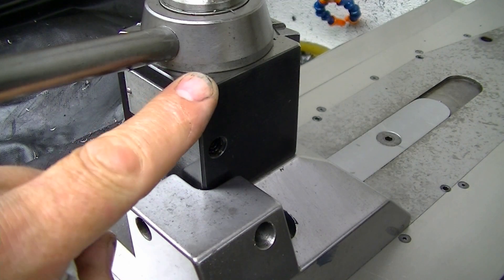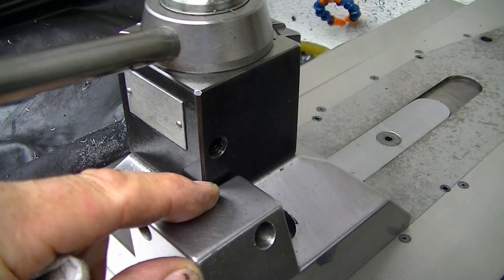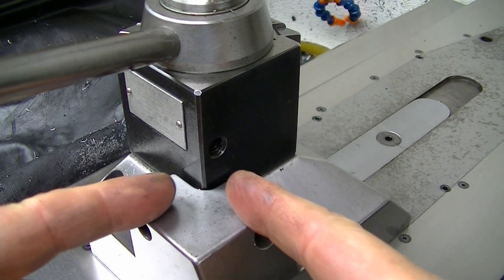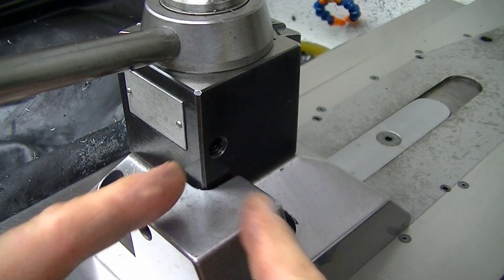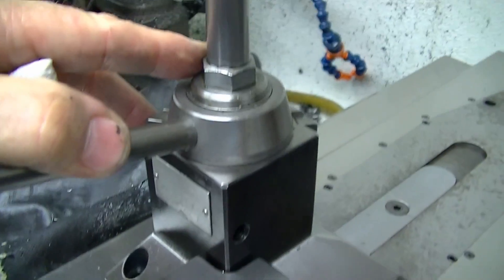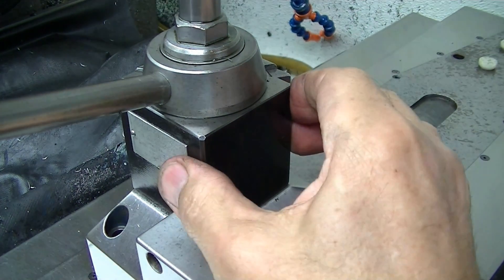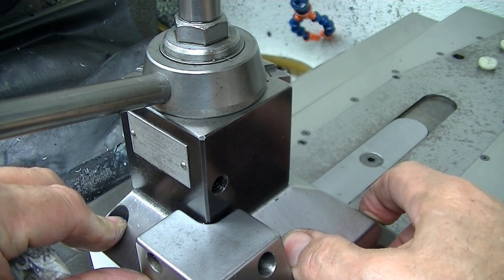There's a corner on the far side of the tool post where a dowel pin hole is hard-drilled into the hardened body. It also has a relief so the dowel pin hits on two spots — a smaller diameter relief groove that allows the dowel pin to sit perfectly centered. Two 3/8-24 socket head set screws forcibly push this thing in one direction, line it up, and push hard against the pin making it immovable. The center post is not what keeps this from spinning — it's just holding it down. This is mechanically held so it cannot spin whatsoever, and with four M8 screws bolted in, it cannot move.